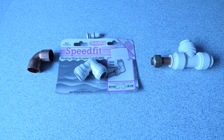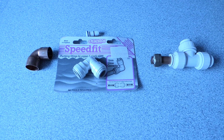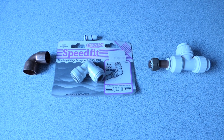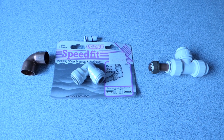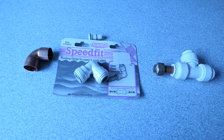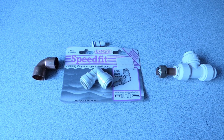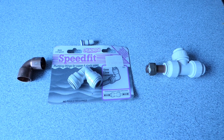I guess the thing is, is it speed you want? It means a plumber can fit it faster, which means it's a bit cheaper. The plastic can be run in long lengths with no joins, and it can be bent and twisted around. With copper, it's rigid and solid — you've got to use bends and fittings to get around corners, or try and bend it with a copper tube bender. So there are lots of real benefits with speedfit that you get but you don't get with copper.